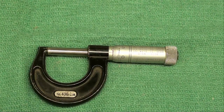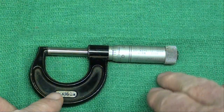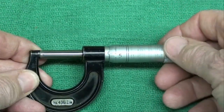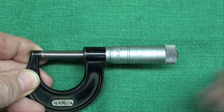When you're buying micrometers, always select micrometers that have a satin chrome finish. They do not corrode, they're easy to read, and all the numbers show up nicely. Avoid the really old ones that are just plain steel — I don't own any of those anymore, so I have no samples to show you.